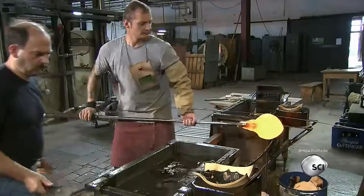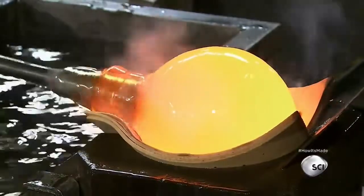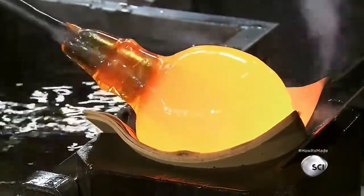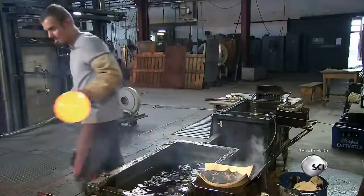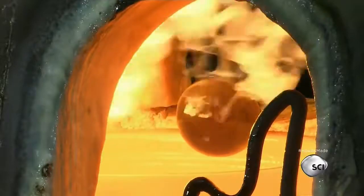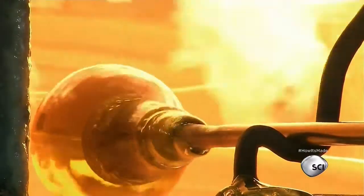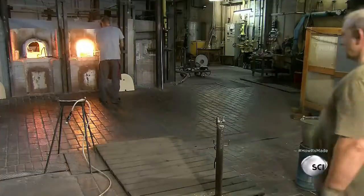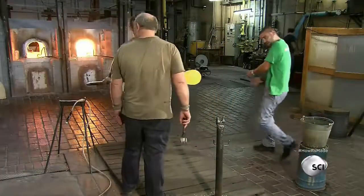The assistant uses a fork tool to push the glass to the top of the pipe. The starter rotates the glass in a larger paper-lined mold to round it further. The molten glass cools rapidly once it comes out of the furnace — if the temperature dips below 1,800 degrees it's no longer workable, so the team must work quickly and reheat the glass repeatedly.